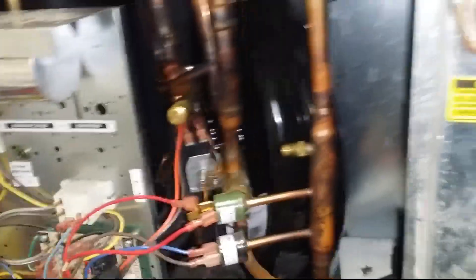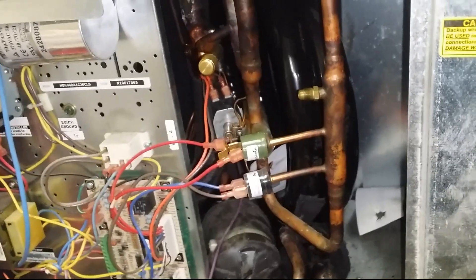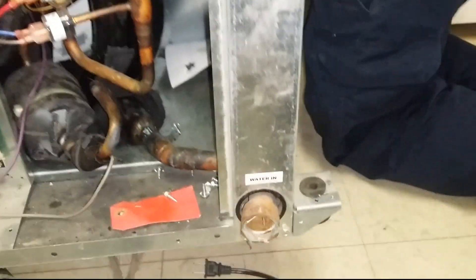It's very important to have proper water temperature. If your water temperature is at 100 degrees, your unit is going to cut off on high head pressure. There's no emergency heat on these units — it doesn't go into defrost, it doesn't have a defrost board. Typical problems I see with these units involve not having the proper water flow and not having the proper water temperature.